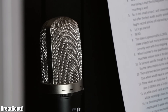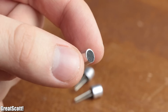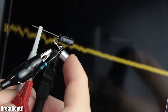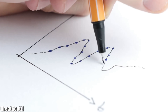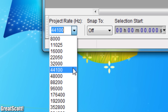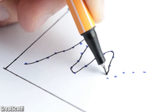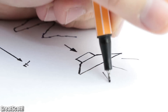When it comes to recording voices, it is nowadays common knowledge that all you need is a microphone and a computer. The microphone creates an electrical voltage according to the sound waves that hit it, and the computer samples this analog voltage at a specific frequency like 44,100 Hz and saves those data points. For playback, the computer reconstructs the analog signal and sends it to a speaker.